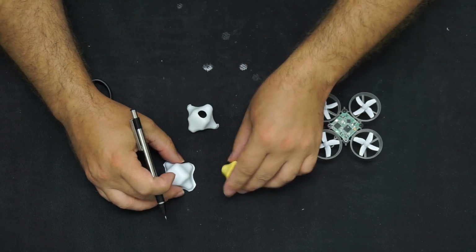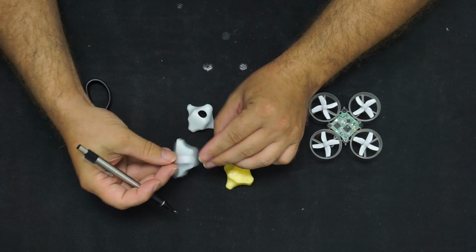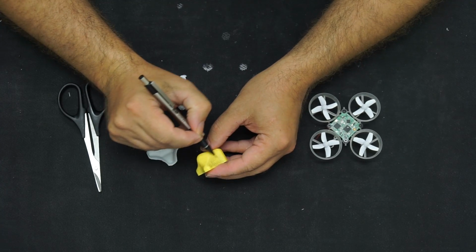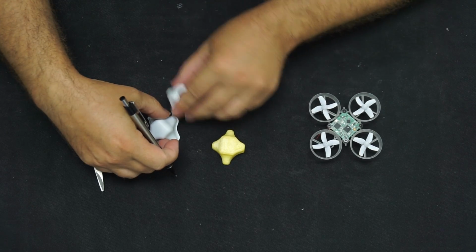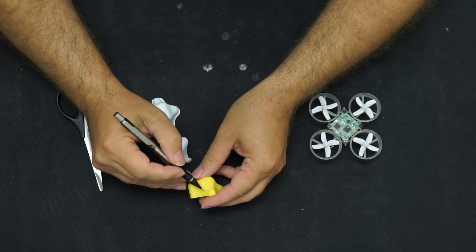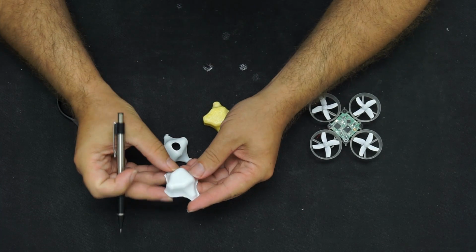But like I said, when I designed this, I designed it with extra in mind, so that's above the cut line. Now the other thing on the cut line is when I designed this mold, I didn't know where I wanted the cut line to be. What you can do in your mold is, once you've determined where the cut line is for it to come around and fit, you could actually go back in and transfer those curves to create a small divot in the mold.